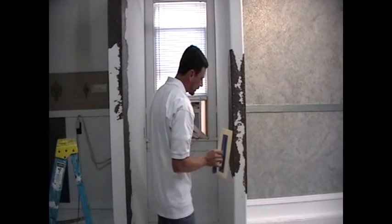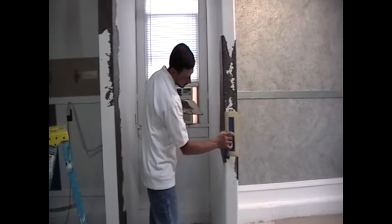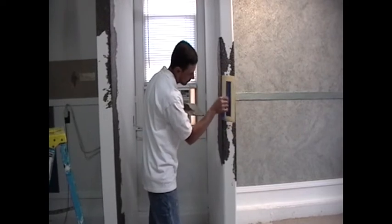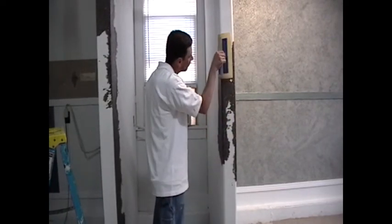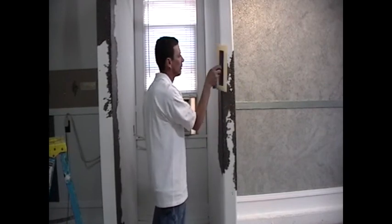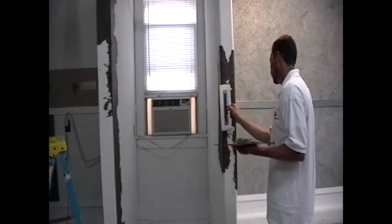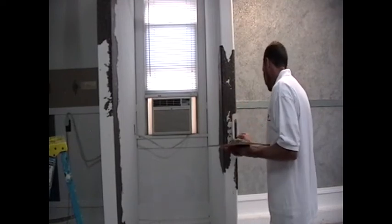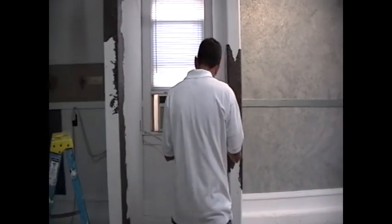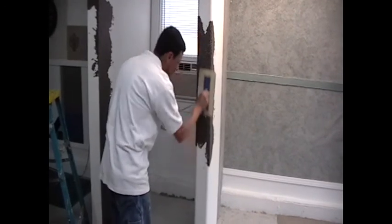Finishing the wall side, he'll now address the stub wall. Very, very little pressure, just folding over these edges. Light pressure, almost like a sculpting movement. Taking any excess material from both sides and filling in the stub before he adds any new material. Using only small amounts. It's very easy to overfill small areas.